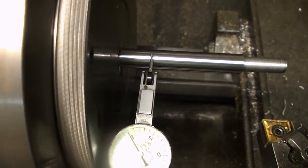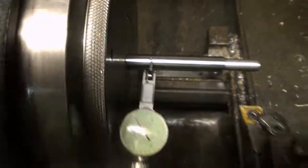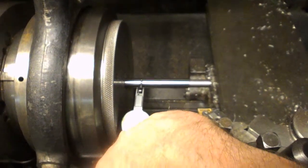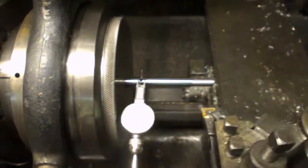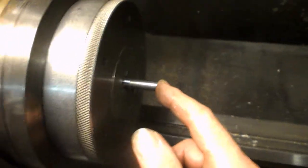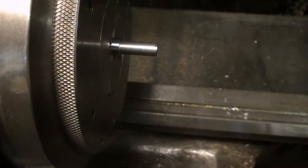Well, that's a heck of a lot better than in the chuck. Let's get our clock out of the way. That's up against the stop. It was a bit closer to the collet than it was in the chuck, but it should still work okay. I don't think we dare try and put the clock on it again just to see - I don't know if it was good before, it should be good now, but let's just double check.